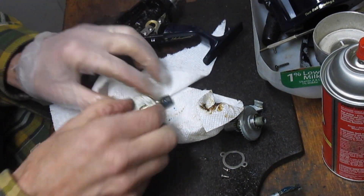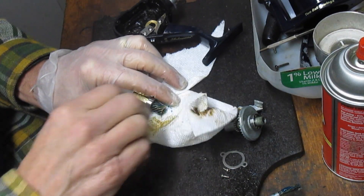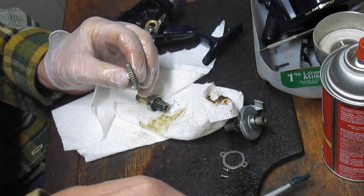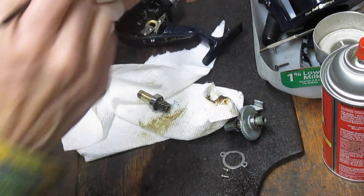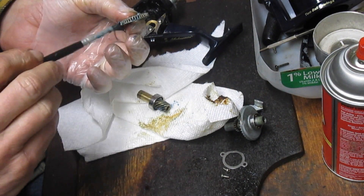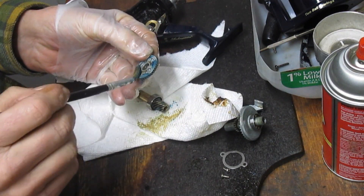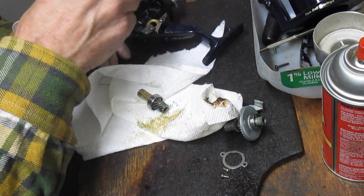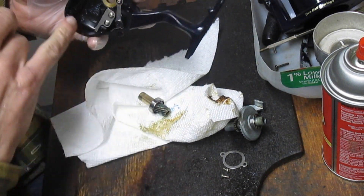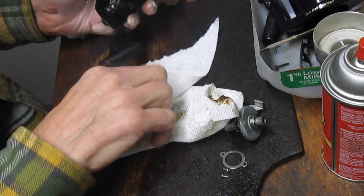There's a little bit of grease on the crosswind block here, so let's try and get the old grease out of that — that's why the paper towel is sitting here on the deck. Check the teeth along the way on the crosswind gear; make sure it's all in good condition. Just a little bit more grease on the teeth before the reinstall. The outer rim is the only thing that rides on the back, so you don't have to throw grease into those slots — that's just wasting grease. Then a little bit on the stud before we reinstall, putting the stud on the crosswind block low.